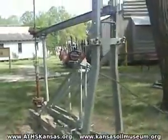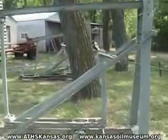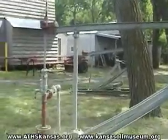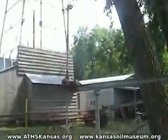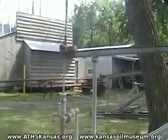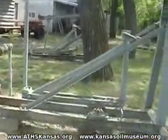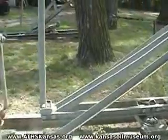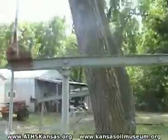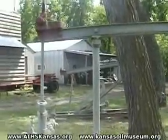This operates a lot like pumping rigs operate today. These would have been used in fields that pretty much flowed by themselves — just like the old movies where they strike oil and everybody yells 'it's a gusher!' and runs away. So they didn't need a whole lot of extra pumping. The cable pulling back on this point would tip this whole thing — it's got a pivot point — and that would raise this rod up. You have a walking beam attached here that pulls the rod up and down out of this pump.